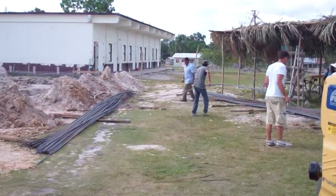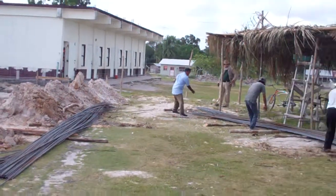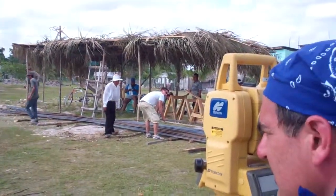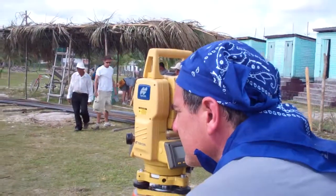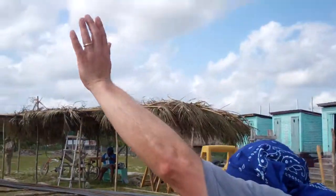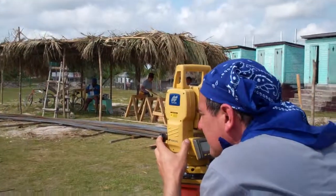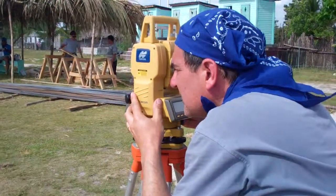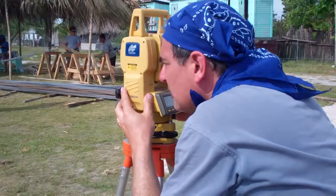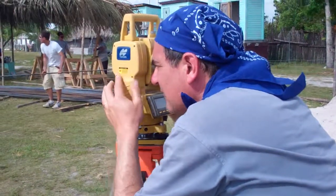If he has to turn slightly, you can adjust it. You hold up the hand on the side that you want him to turn towards. So I want him to turn the prism — rotate it — towards my left, so I signal that direction. He'll rotate it, and when it's done I just signal that it's perfect. Make sure everything is in line both horizontally and vertically so that the target is in the center of the prism.